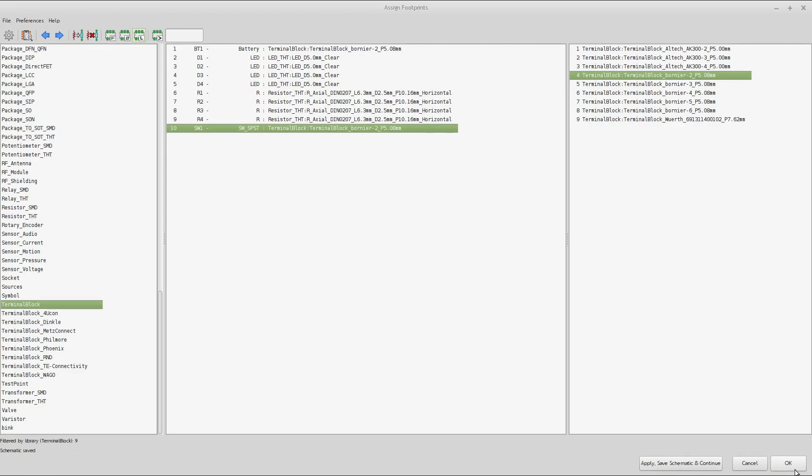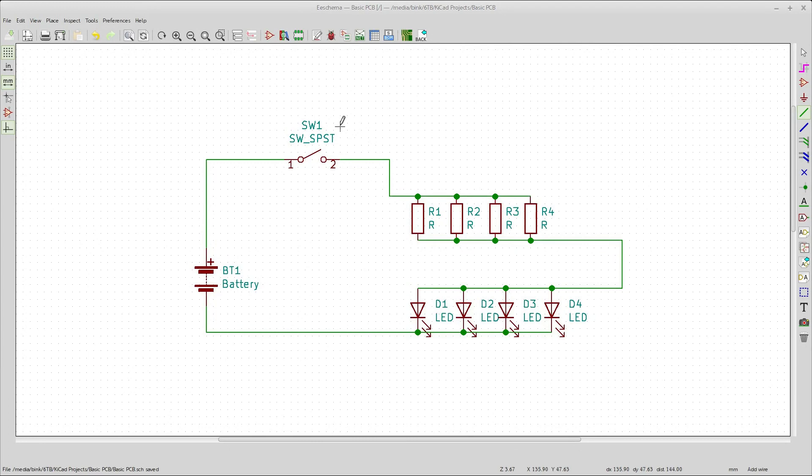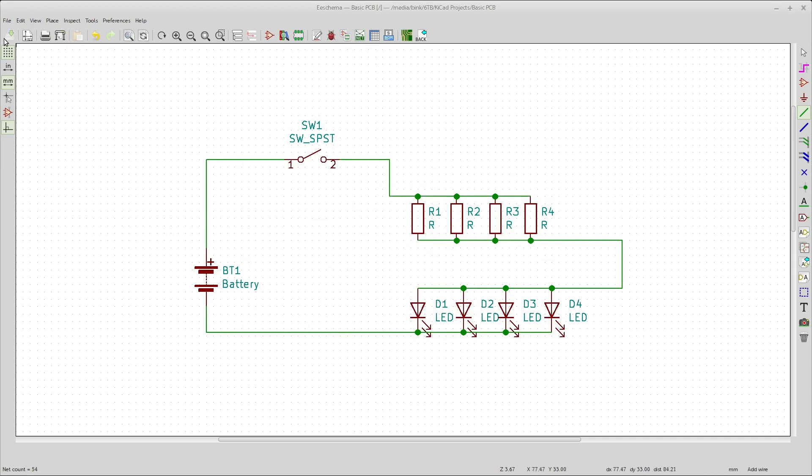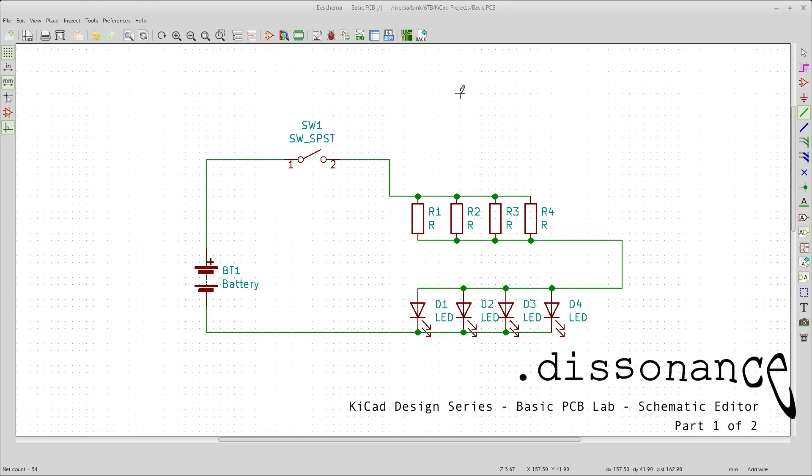Down here, hit 'Apply and Save Schematic', then Continue, hit OK — that part's done. To review: pick your schematic symbols, place them, wire everything together, annotate everything, run an Electrical Rules Check, associate everything to an actual footprint — that's the part that takes a little time. Then generate the netlist right here, hit Generate, throw it in your file where it's already going to go, hit Save Netlist — done. Close out. That's it for the schematic. The next video is going to be turning this into a PCB and shipping it over to OSH Park.